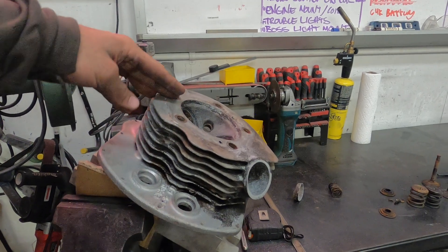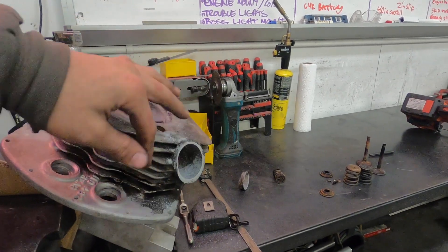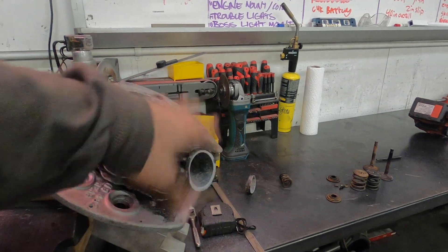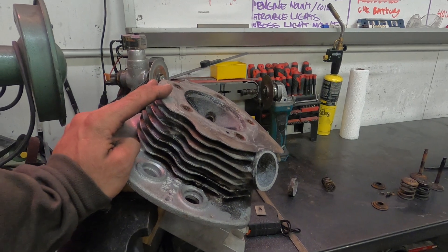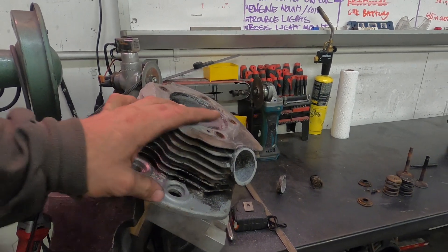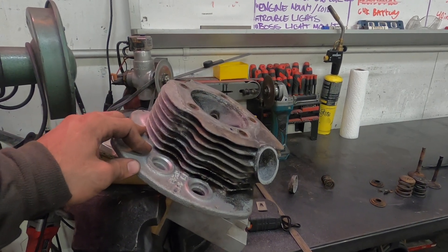While it's like this, before I start sanding, I'm going to put it in the blasting machine and do a quick bead blast — just in all the areas I might get hot or need to — just get most of the grime off, because this aluminum is already not easy to weld. So bead blast this real quick and we'll come back and start welding.